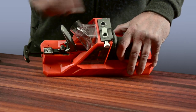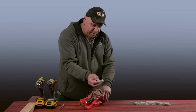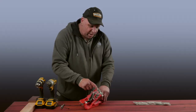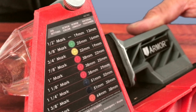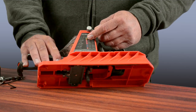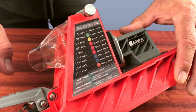There are two holes for drilling the pocket holes. There's a knurled nut we can undo, take this part out, flip it over, and drill the holes a little bit closer to one another — that's another nice feature. We also find a scale here which comes in both metric and imperial. It helps the user nominate the size of screw they want to use, and also determines the collar setting on the drill bit by referencing the thickness of the stock you're drilling into as well as the thickness of the stock you're joining it up with.